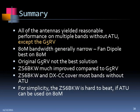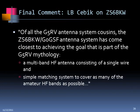In summary: all the antennas except the G5RV do really well without an ATU. The 80-meter bandwidth is fairly narrow almost across the board, except for the fan dipole. The original G5RV is not the best solution. I would say the ZS6BKW — if you're going to build one of these — is really a pretty good way to go. It's simple, it probably works very well, and for simplicity it's hard to beat, particularly if you've got an ATU available for 80 meters.